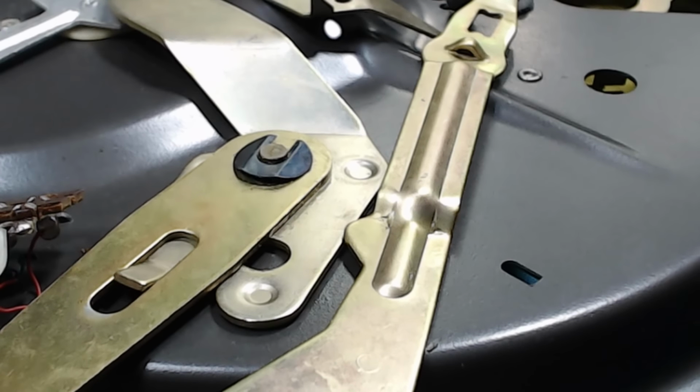So here's the wires. That's ground. That's okay. Oh, there we go. Whoa. Right, well, one's ready. Yeah, nothing there. So only one side of the cartridge is working. I'll put it back here, the one that wasn't working. I should be able to put my finger. That's crackling.